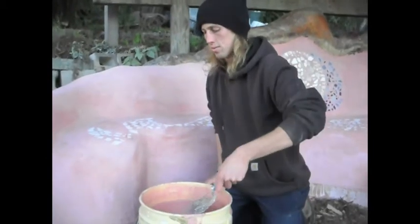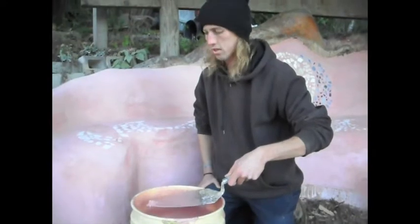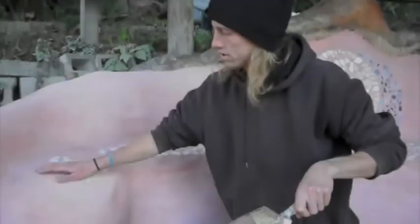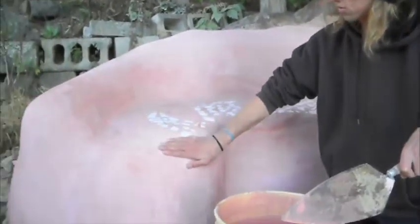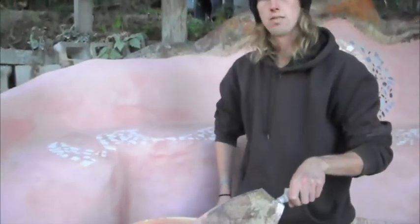Then you smear this patch on there and rub it in really well with a rag until the crack is filled and you no longer see signs of a crack. It's important to make a very smooth layer, a very thin layer, because otherwise the plaster will have differences that are obvious to any observer. So you want to fill that crack, but you want to rub most of the remaining plaster off of the bench nicely so that it doesn't leave any signs of your patch.